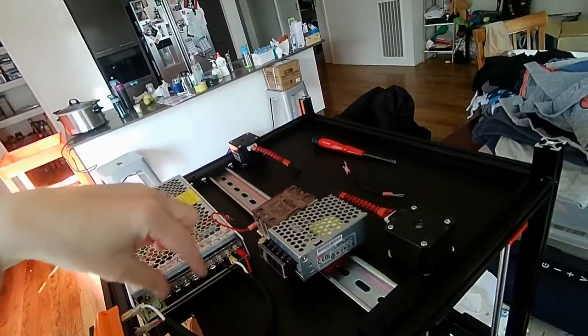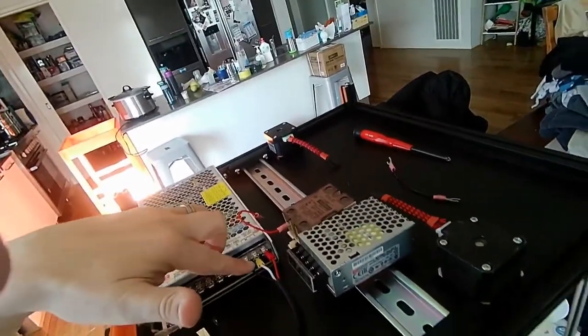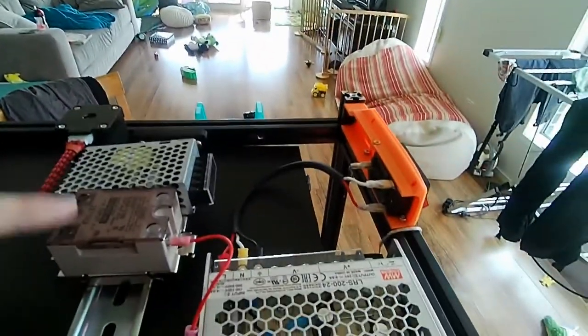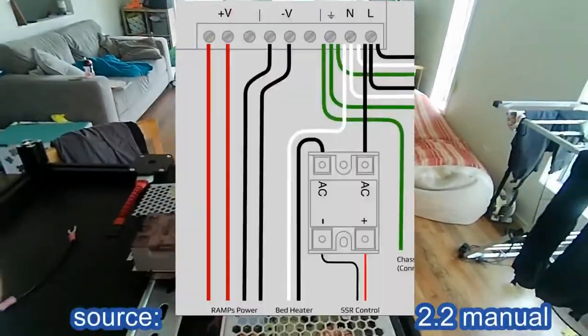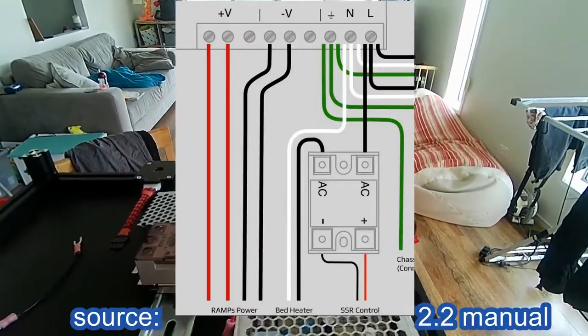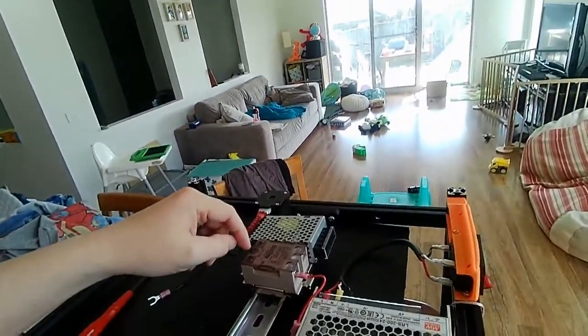So what happens is you've got your power going into here. This 200 watt 24 volt power supply will then output your 24 volts to your SKR board - I'm not going to cover that in this video. What I am going to cover is: we've routed this bit up here, what happens next? So have a look at this thing here. This is called an SSR. You can see up the top it's got 'load' - so that's your power from your outlet. And on this part here, this is the wiring that would go back to your SKR board.